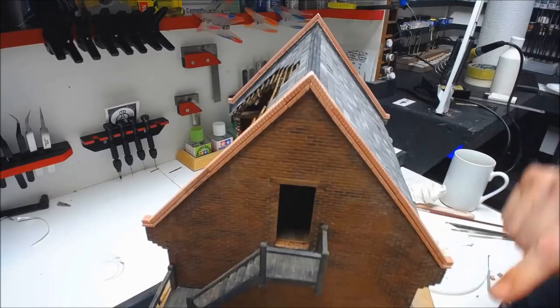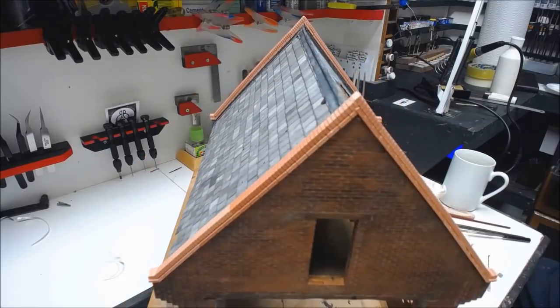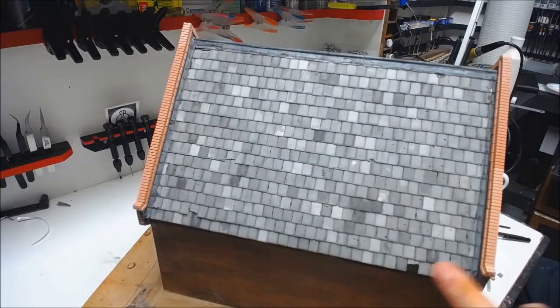All the soldier courses are now glued on — both ends done. That looks pretty good. The gables are finished off. Now I just need to give that new brickwork a coat of ground wash with a 50-50 mix, a coat of black at 50-50 as well, and they also need grouting up. When we come back we'll get started on the guttering, downpipe, and I'm going to replace that broken tile too.